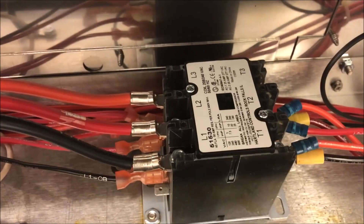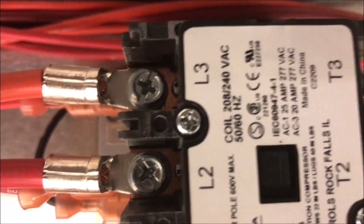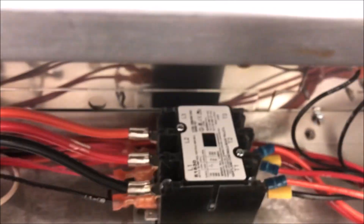We're going to do our visual cues. I kind of heard the contactor pulling in there — I'll try to catch it on camera. The contactor has pulled in. So that's our first visual sign, telling us our safety loop is good.